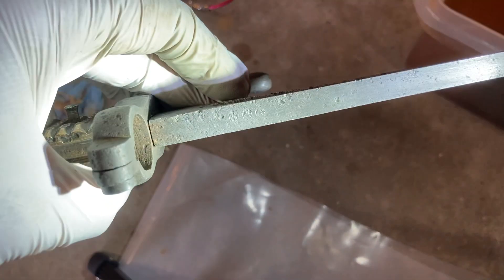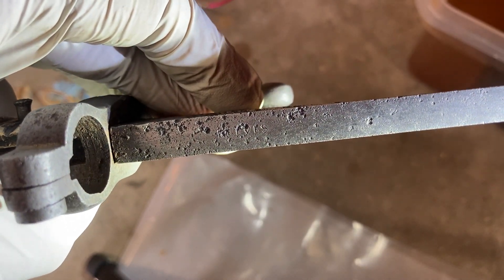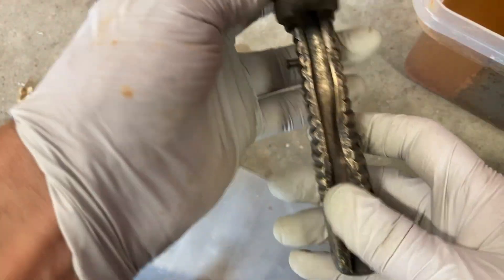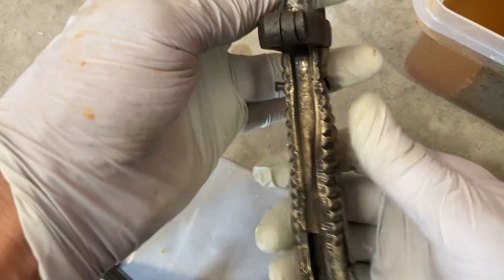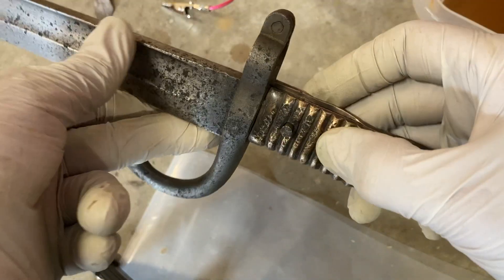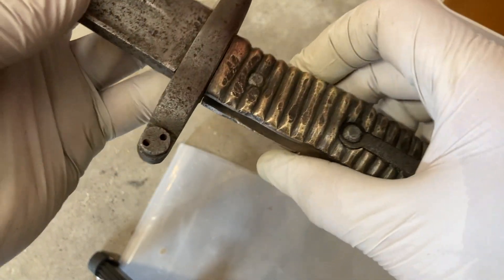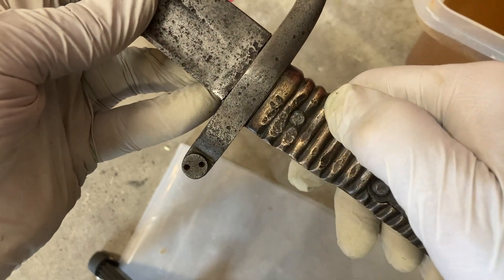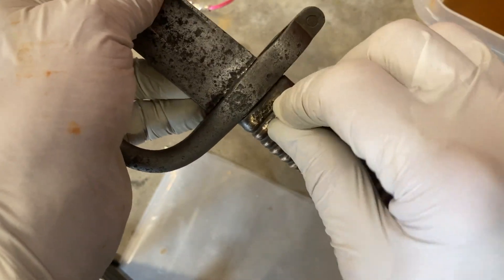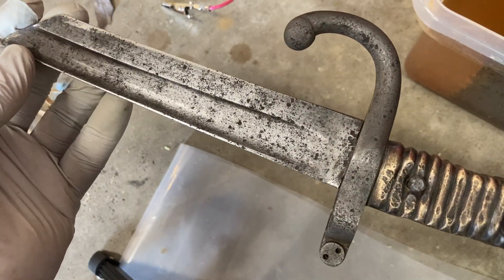3,400 — not bad. 'Reeves' — and I think that's really the only for-sure maker's mark I can find on it. You can see how damaged and deformed it is — this pin should have been tight, but the body has been crushed from both ends, pushed in. It looks like the pin was twisted in between that happening, because it fits right in here in this depression perfectly, but then to get it to fit in the other one it's got to push through and rotate slightly.